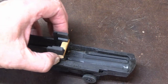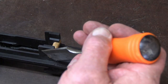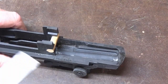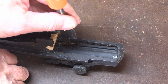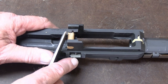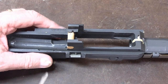Now, not only do these ends have to be flush, and ensure it with your fingers are the best gauge. If you feel any protrusions, shave them off with your chisel and make sure that there's nothing there. Next is to make sure that this back surface is flush before we put any epoxy in there. Use a straight edge and see if there's any protrusion of that dowel. If you feel any protrusion of that dowel, that has to be removed. It's actually quite flush. My steel is on steel there, so that's completely flush, and there's no protrusions that will hook around.